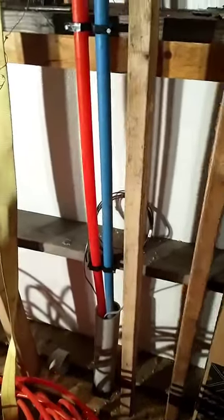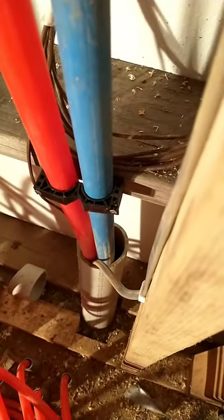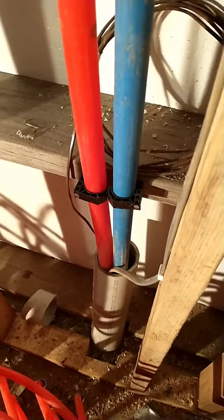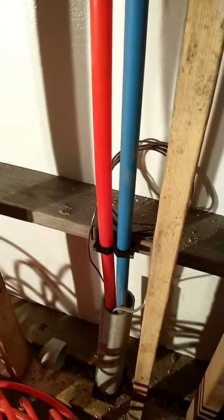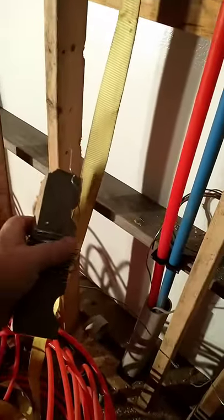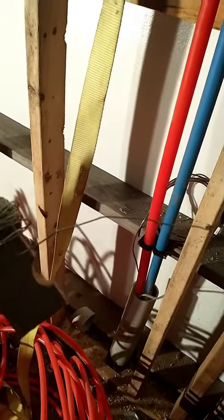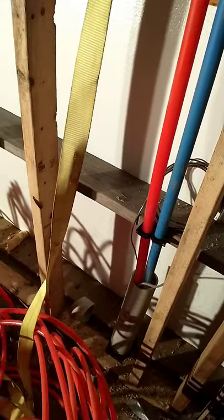We can show you the conduit that we had to pull that through. So you can see there was plenty of room, but going around the sweep elbow down in the ground proved to be pretty difficult. So I tried several things. We ran some wire through that conduit with a fish tape, tried to pull it. I tried wrapping it around this block and pulling it by hand. This is like fencing wire. I just broke it when I was trying to pull through because it wouldn't move.